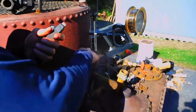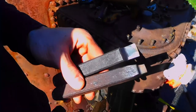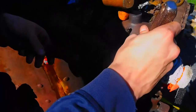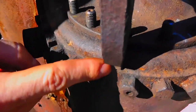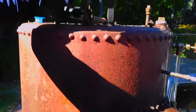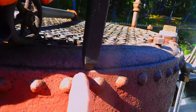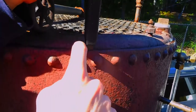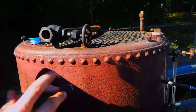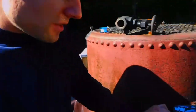But these are the irons — I made these myself. Tom Bonomi helped me out with hardening them. You put them at an 80-degree angle like this — 90 degrees would be straight across, 80 degrees is up like this. If you're on the tube sheet, you go like that. Basically, all you want to do is mush the sheet into the one it's butted up against. That's what makes the seal — you form the steam seal by actually forming one sheet of metal into another.